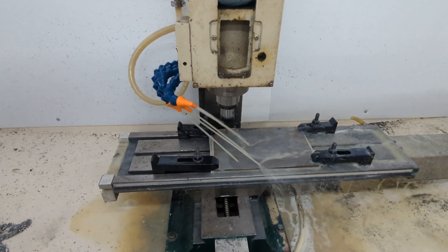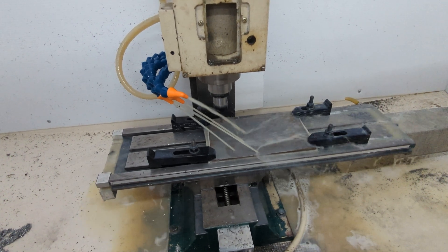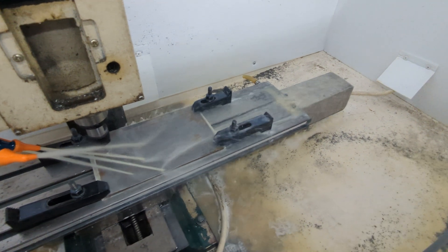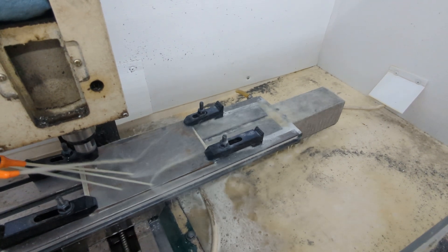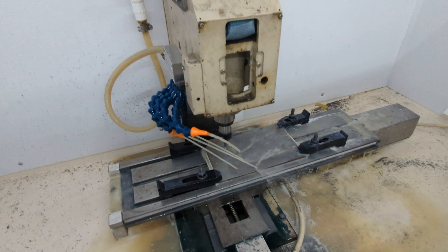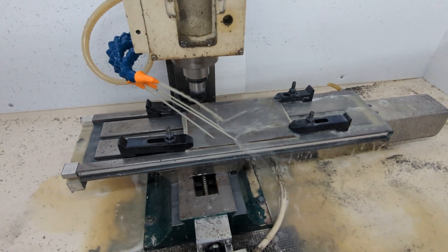So we're back and this is pretty much what I was looking for. I'll turn it up and show you how much volume it can put out, but I really like the multiple nozzles because I think it's going to help get chips out from either side of the cutter. At full flow it outruns my filter and I also seem to get a lot of foaming — not 100% sure why, it might just be that the pump isn't designed for this application. I leave it at about two-thirds and so far I've been pretty happy with it. I'll roll in that other footage and see you guys in the next video.